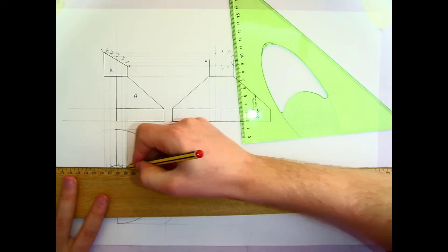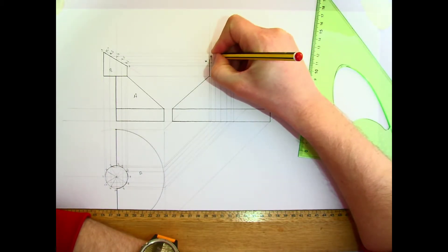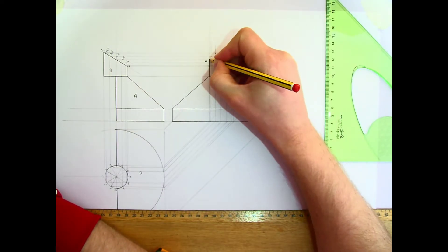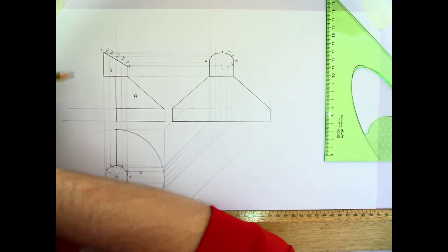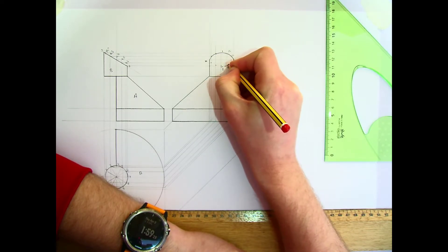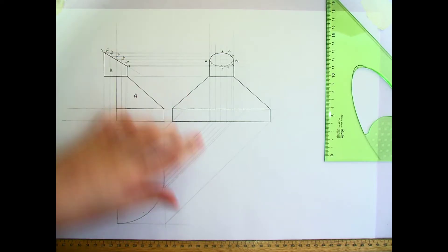The final ones I need to bring up are 3 and 5. The reason I divided this up rather than drawing concentric circles is that I'm going to need those points later when dividing up the cylinder, so I'm not doubling up on work. I'll draw in the curve now through all the plotted points. Looking in from this side, this side is down low and hidden behind, so I've got hidden detail here represented with dotted lines. That's our end view complete — I've got the elevation, the plan, and the end view all completed.